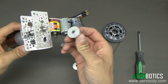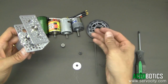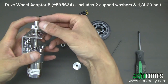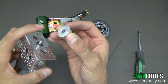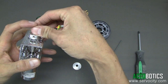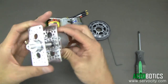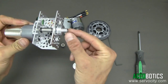Now we're going to take this one step further and show you one of our new skate wheel or robot wheel mounts. This one goes directly onto the quarter inch shaft — line it up with the D. You can see these actually have a little lip on them so they run right on the race of the ball bearing. Line that up and tighten that up. Now you can see we're almost complete, and this actually has a quarter-twenty thread right in the end of it.